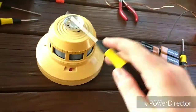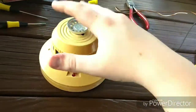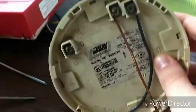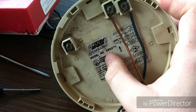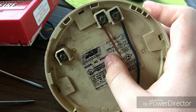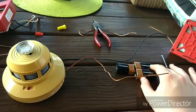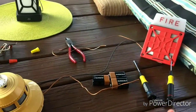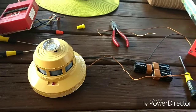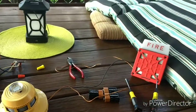You would have a hard time powering this detector to a 12-volt device unless you have a System Sensor 2412TH, which is just the 12-volt model. This is a 2400TH, which means it is a standard 2400 that has a thermal sensor and heat element. The 2400 runs off of 24 volts DC, but if there are other numbers such as 12 in the model, it will run off 12 volts. With that being said, if you have any questions please list them in the comments — I'll help any way I can. If you want more videos like this demonstrating how to wire a detector or alarm, let me know in the comments. Hope you guys enjoyed, and I'll see you in the next one.